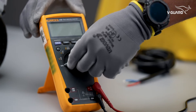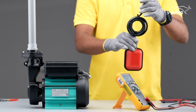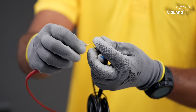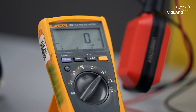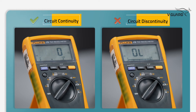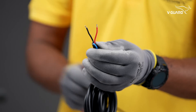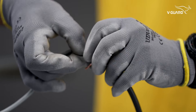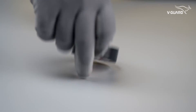To do this, set the multimeter to continuity mode. Let the float switch hang down. Select any two wires and connect them to the multimeter leads. If the multimeter reading shows zero, it means there is continuity — these are the wires to be connected to the pump. The third wire can be insulated. Now we are connecting the two identified wires to the pump. In this case, it is the red and black wires — these should be joined together with the red and black wires from the pump. Once these wires are connected, ensure that they are properly insulated.